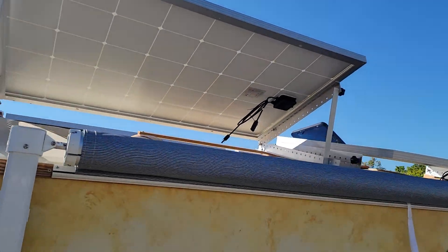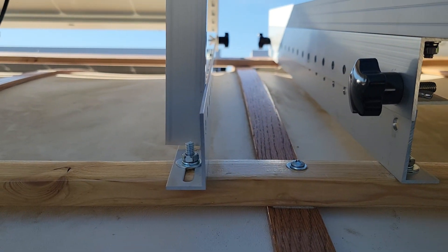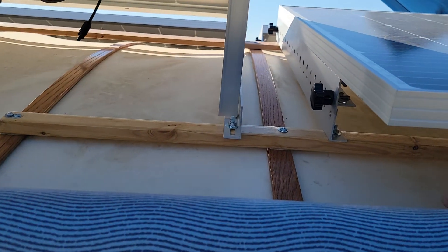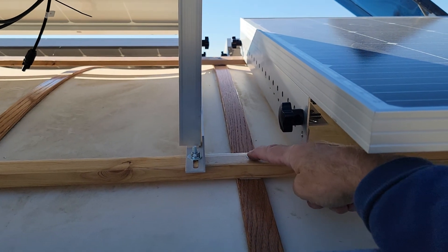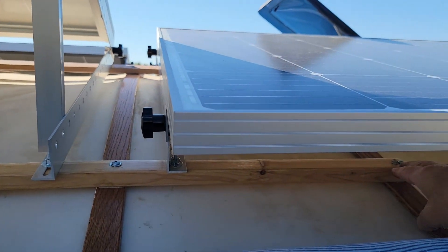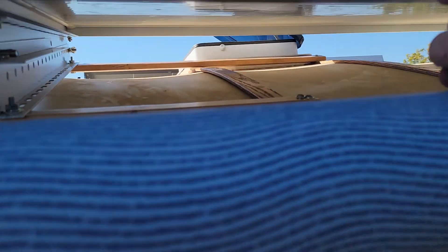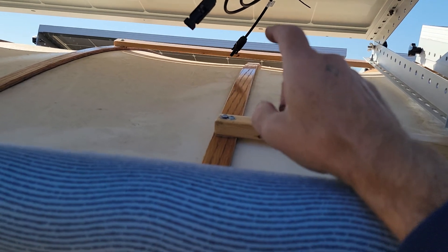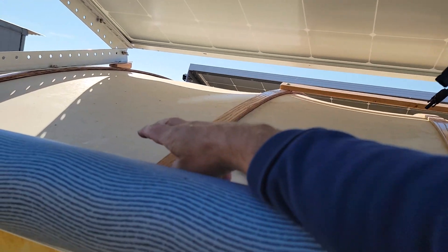On the inside the bolts don't match up with my center beam, so I created pieces that span from beam to beam. The top and bottom bolts each hit the center beam and are bolted in there. The bottom one spans to the next two beams and is bolted into that beam, and the top one spans over to the next beam further out — that way it distributes the weight of the panels over all the beams instead of just on a single one.